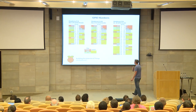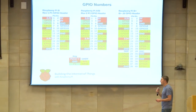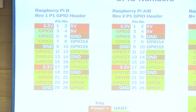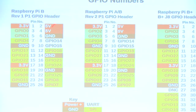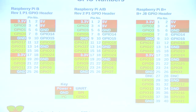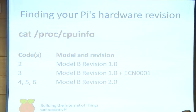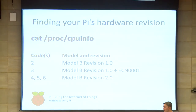On to the software — first, the actual GPIO mappings. The Raspberry Pi Model B brought out Revision 2 in about 2012, with some slight configuration differences in the hardware from Revision 1. You'll notice some slight differences between the two diagrams. The one on the right is the Raspberry Pi B+, which has 40 pins and considerably more GPIO outputs. If you're not sure which revision you have, you can just use 'cat /proc/cpuinfo' and it'll spit out a number that tells you your actual hardware revision.